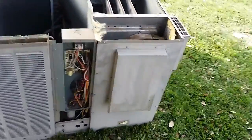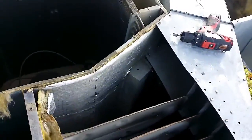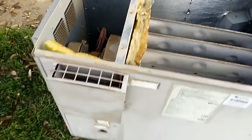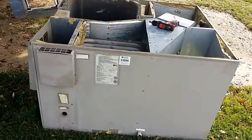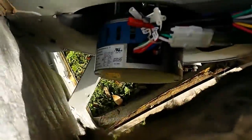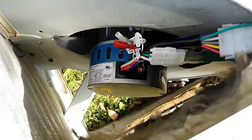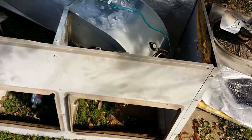This unit is actually from 2004, and about a month ago I replaced a heat exchanger for one of these same units. So if you guys see one of these brown Goodman units, double check that heat exchanger. They also put a variable speed motor in this one before they even knew it had a cracked heat exchanger.